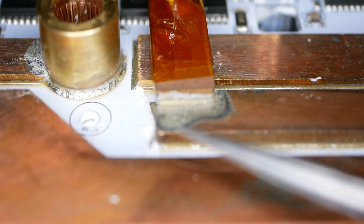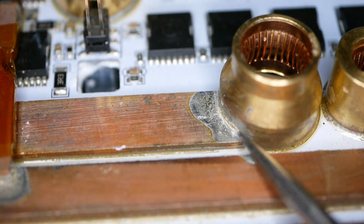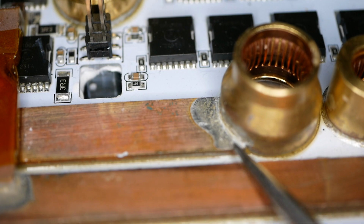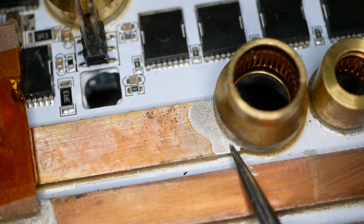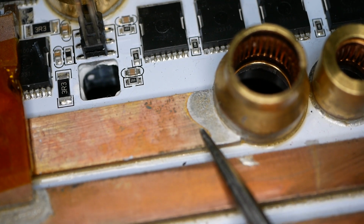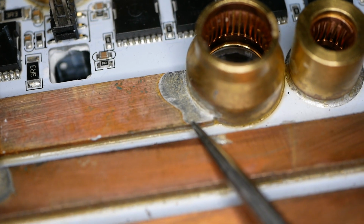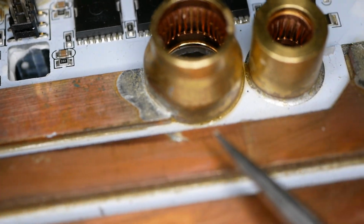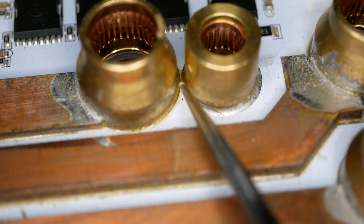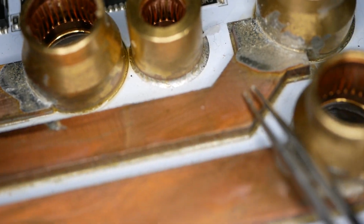That's a good solder joint between two parts. You get the same thing here. You know, you just got a 90 degree. It's enough for this one because there's no little void underneath it or a low spot or anything like that. But a perfect solder joint is one where you have that gentle slope from here up to here and not a 90 degree. Definitely would have put something between those because that's a current path gap.